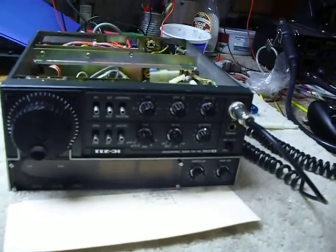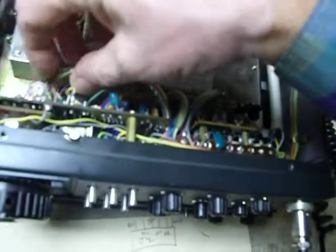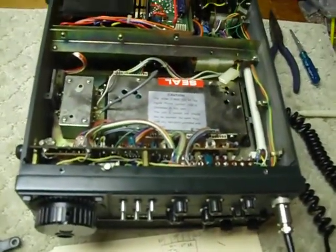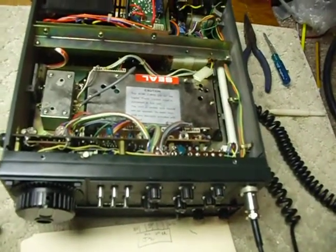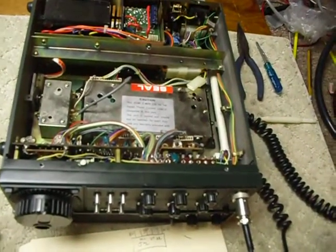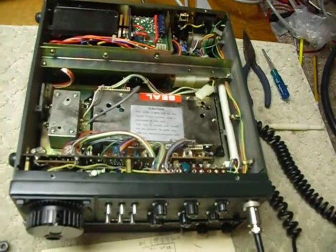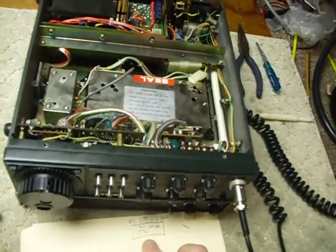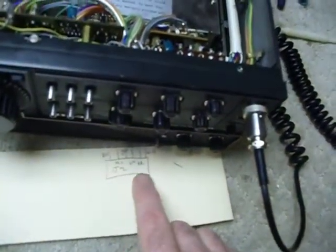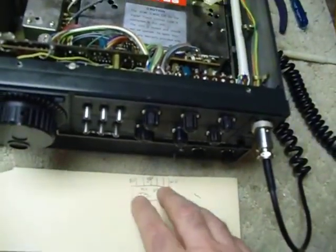I thought sure it was one of the pins soldered into the board with a loose connection. I pulled the connector off and, just to be sure, took the little pins out of the connector. You take those little pins out with a jeweler's screwdriver — you stick it into the connector on the side and press down on the little tab. There's a slot for that, and while you're pressing down, you pull gently on the wire and they'll come right out. Then I took my soldering iron with a very small tip and 15-thousandths thick solder and ran a little bit of solder into where the copper wires were in that connector. These connectors looked beautiful — they looked like they were making good connection to that wire, but they were not. I soldered all those pins and put it back together and the thing works beautifully now. Be sure that you make a drawing of the connector showing what wire goes where and what color before you do that.